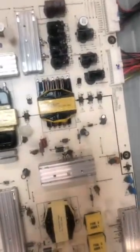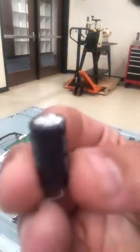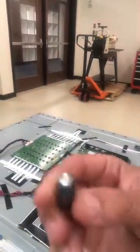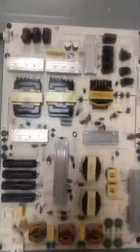So I'd rather try to repair than buy another one. When I looked at the capacitors, you can see there are some capacitors here on top and some here. I could see that some of them were popped out — popped out means they are bowed. Usually capacitors are flat on the top, but some of them were a little bit bowed out on the top, which means the capacitor is bad.